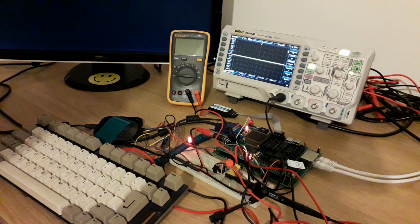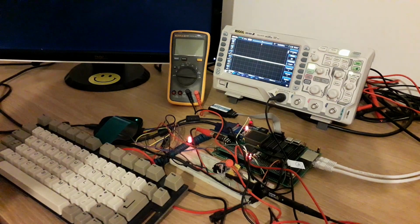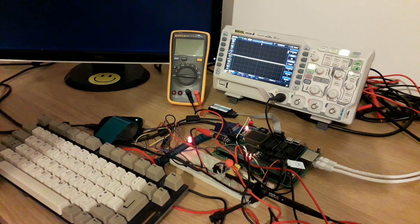that is, the good old Atmel 28C256, a DUART, which is the XR88C681, just because I happen to have some hanging around, and a CPLD, the Max 7000 from Altera in PLCC 84. So that's the board that's underneath the top one. That's all pretty straightforward stuff, really.